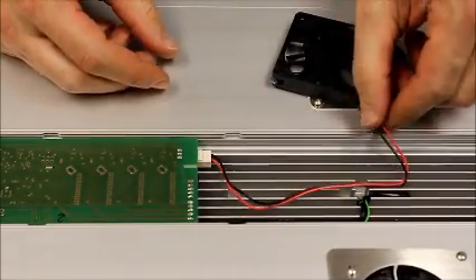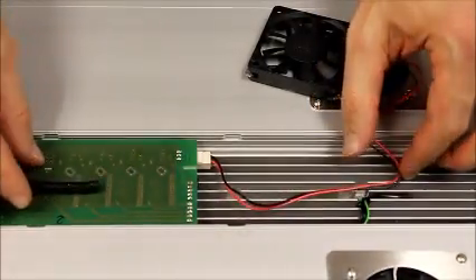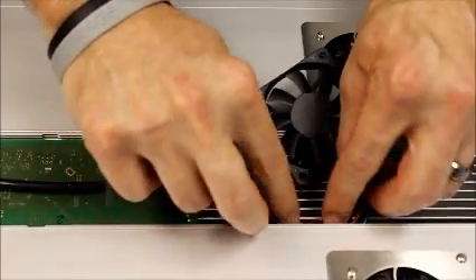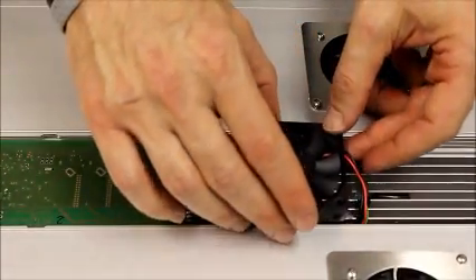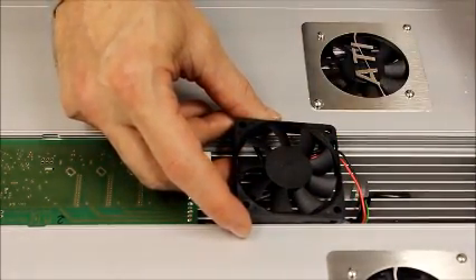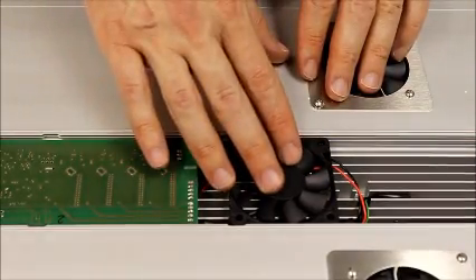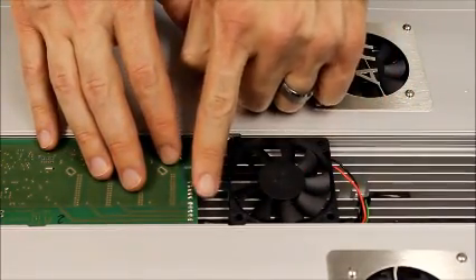Next, tuck the fan wire back in place. Remove the black tubing from the lamp cord side of the KSQ, tuck the black and red wire into that same trough — it should be pretty bent from earlier so it feeds in easily. Put the tubing back in place to hold it all together. Then lay the fan in place with the label side of the fan down, and the black and red wire facing towards or in parallel with the lamp cord side of the fixture. The exact position of the fan may need slight adjustment when you put the metal plate in — roughly about a finger width away from your KSQ.